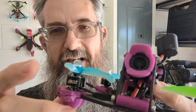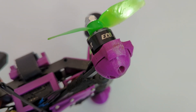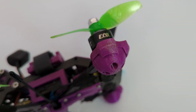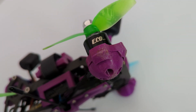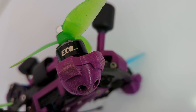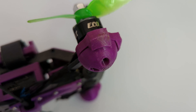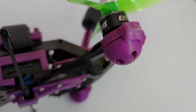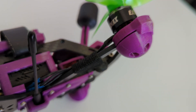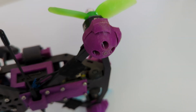So what do I do to protect the ends? I've got two parts. One, I've got landing skids that go underneath here — that protects the screws and the bottom on landings. And then this end piece goes over top, wraps around that skid, and protects all of the end. If I take hits, it's the TPU taking the hit, and eventually the TPU wears out and you just replace it — print another one, pop it on. The carbon doesn't get damaged unless you let the TPU get too bad.